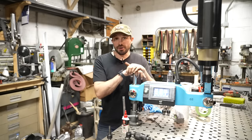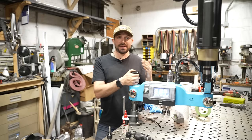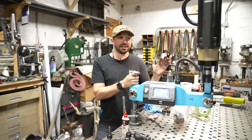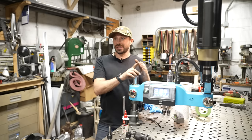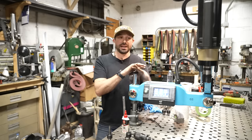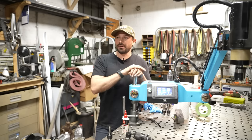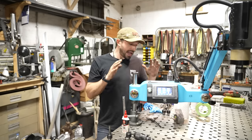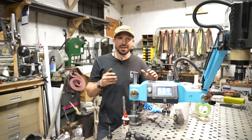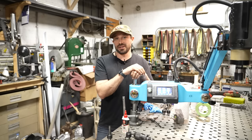This isn't a product for everyone, but for me this has made me thousands of dollars. Because of the accuracy and speed, I'm able to do jobs faster — and in my shop that's really important. I have every other option for tapping aside from a CNC machine: Tapmatics, rigid tapping machines, a bench set up with a mill head just for tapping, tapping on the lathe. I choose to use this all the time because it's so much faster and I can move this to the work. I chose the electric one versus pneumatic — I sold my pneumatic to buy this because I can just plug it in and move it around the shop. I can even bring it to someone else's shop. And I'm working on an accessory that's going to make me not have to clamp or bolt it to the table — but you'll have to wait for the video on that one next week.